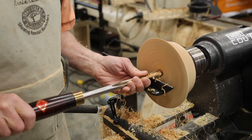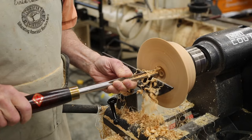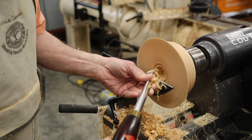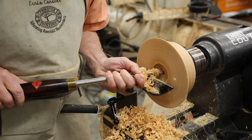Scrape cut until I get in there a ways, turning the gouge counterclockwise as I come around. Now I have a ledge for the tool to register on. I turn it a little until it becomes sweet and then swing the handle around to me to come across the bottom, continuing to turn it counterclockwise as I come over — down to a very small piece — and I'm always on the center line throughout this cut.